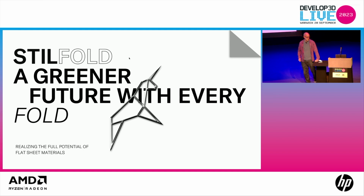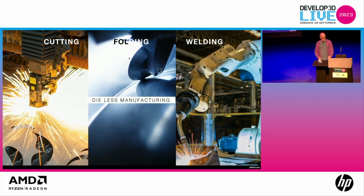We use robots to fold, and we use proprietary software to find the folding patterns to realize the full potential of flat sheet metal. And what's different with this? What we're doing is taking the higher refinement back to the workshop, just like the blacksmiths did. We're using die-less manufacturing instead. We're using an incremental forming technique where we fold along an English wheel with robotics. And we have a folding mechanism mechanized around that, so we can do it at a quite good tempo. Other than that, we use ordinary processes like cutting out the pieces and welding them together.